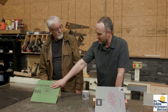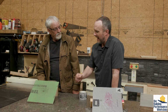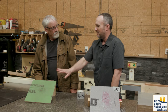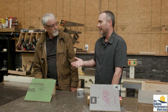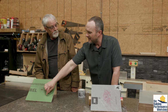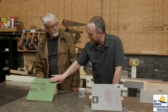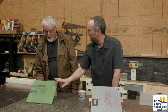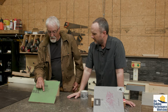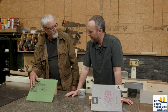But when this is on a roof, we used a standing seam metal roof on ours, and I thought, okay, great, I don't have to worry about water getting back behind that. But if you use shingles, I like to assume that they're going to leak at some point. Yeah. If you got a ton of nails through this thing, is this thing self-sealing against nails that are not overdriven like this one is right here? Yeah, this would be a nail that would be overdriven, say, in the installation of the sheathing to the rafters.